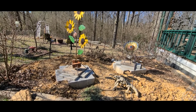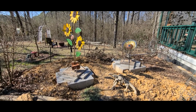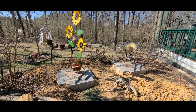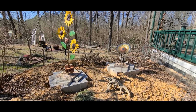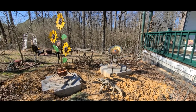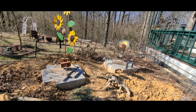This one, I don't think the septic tank has been serviced at all since they built this place and we bought it. One thing that started happening is we started getting some gurgling coming up from the toilet, and you can hear it while you're running the water. That's one of the major signs you want to watch for, so you take care of it right away before it starts coming back into your house. So we were able to get that taken care of.